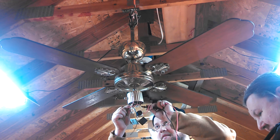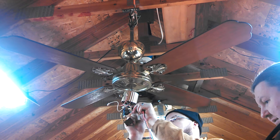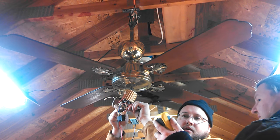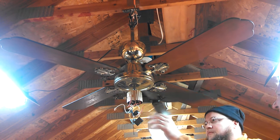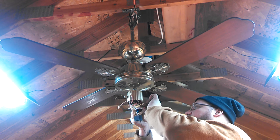200 microfarads, so it should be set to 20. Oh, this should be 20. My apologies. Getting a reading? Yeah. See? It's good. So we did that entire video to find out that the cap was good. But that's okay, because now we know that these current ratings are accurate for this fan.